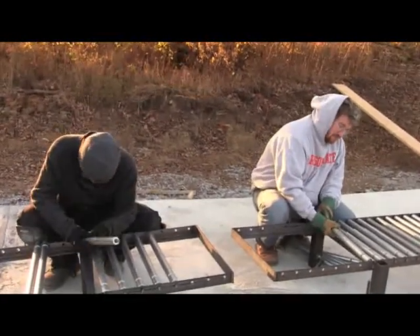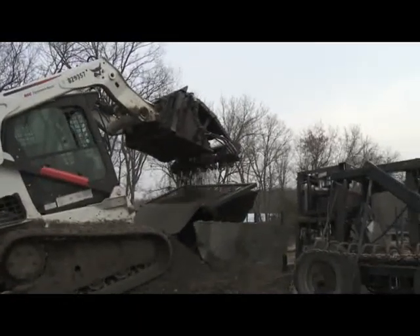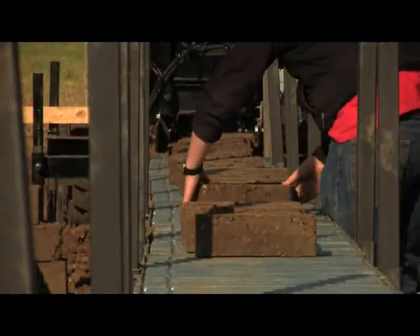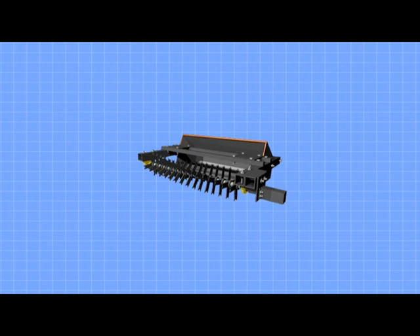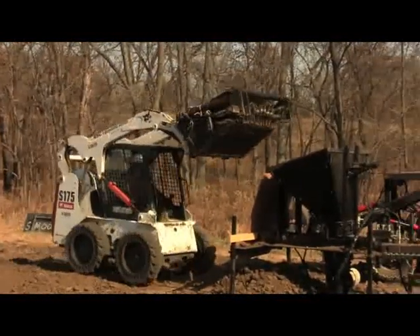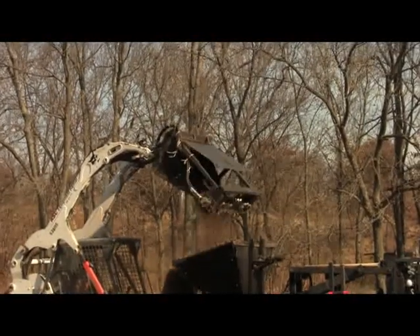The brick rollers worked well to help in materials handling. At most, we pressed 1,900 of the 30-pound bricks in one 8-hour day, with one person driving the soil pulverizer and one person stacking bricks on pallets. We used only half the machine power, or 27 horsepower, as bridging of wet soil in the hopper was an issue and it prevented faster production. The workflow and materials flow has to be perfected for us to use 54 horsepower, the rated power for the machine. We will also try the variable displacement pump to increase brick production while decreasing power requirements. As reported before in a blog post on the first soil pulverizer prototype, the soil pulverizer really did annihilate the soil handling limits. Recall that soil handling ability is the key to effective construction. A full pulverizer bucket could be filled and taken to the CEB press in as little as 30 seconds. On some days, we actually had two machines pressing at 4 bricks per minute, and the soil pulverizer had no problem keeping up with this.